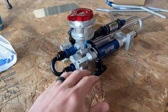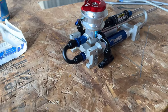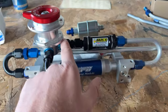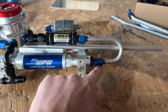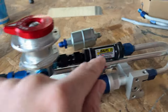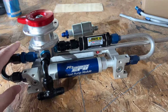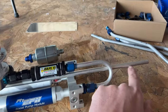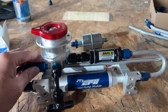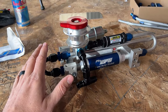You can see here how this is going to be working. We have the fuel lines that will come forward to here, and the fuel lines from aft will come here. They will feed into the right and left selector, go forward through this, and then it's going to go back through the check valve the way it's supposed to, and then turn around and come forward to the firewall up here. I'm going to be wrapping this inside of some protective layers so that it doesn't have any problems with rubbing or chafing. That is my overall plan and design for this.